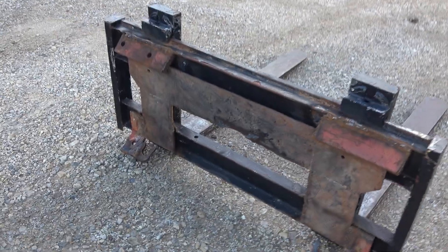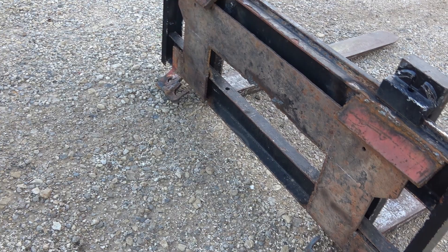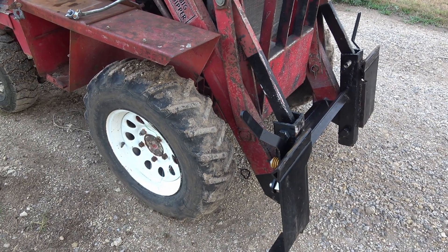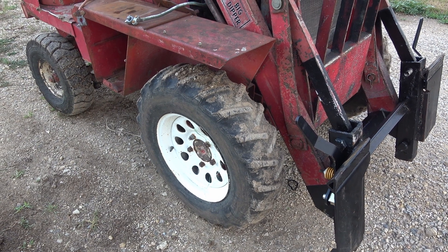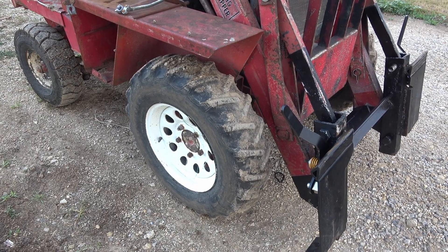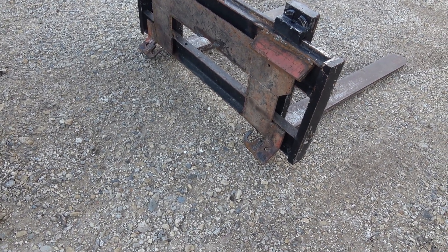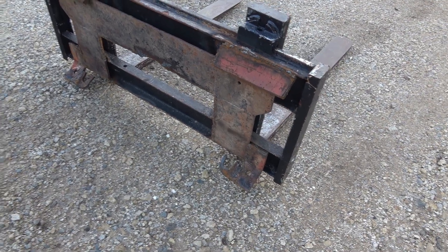I'm really happy with how this worked out. The loops I used for my pins to go through to lock it on aren't really too ideal, but I'm not too worried about it with this mobility loader, because being that these are pallet forks, I'm not really going to be putting down much down pressure at all. And being that this loader is front-wheel drive, if you do put down pressure then you can't go anyway because the front tires don't have any traction. So if you're building something for a skid steer that's going to have some down pressure, I recommend using a better loop for it to lock onto.